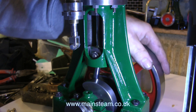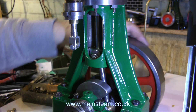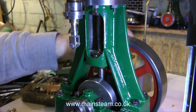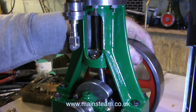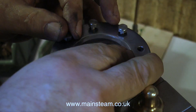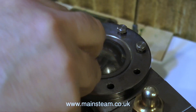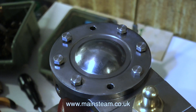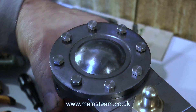With the last stud securely tightened and not sheared, it's time now to rotate the engine and see what it feels like. It's okay until you get to here, then it's tight — just this little bit, there's a tight spot. But it's not at bottom dead centre, it's just after bottom dead centre. So I can safely say that the piston is not fouling the bottom cylinder cover, and in that case I don't need to remove the piston. So what I'm doing now is fitting the top cylinder cover. This is the exception to the rule — all along I've been saying this engine was very well made, but this top cylinder cover only goes in just one position, and I had to rotate the cover several times before the bolts would all go into their respective threaded holes.